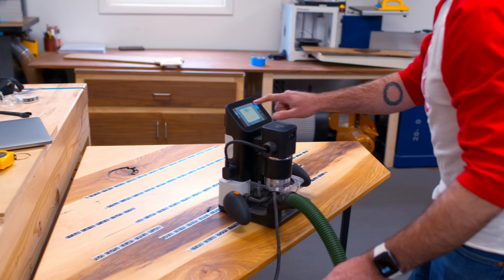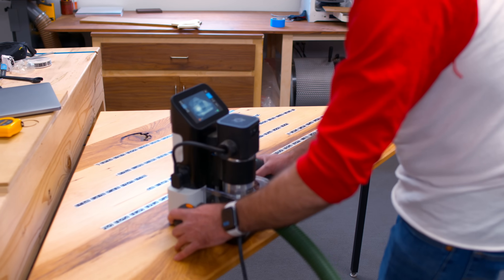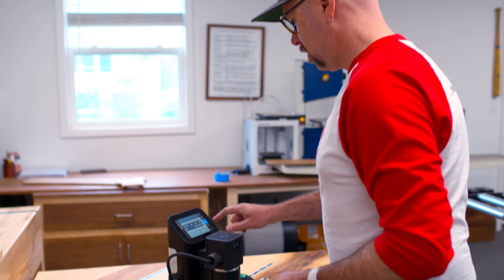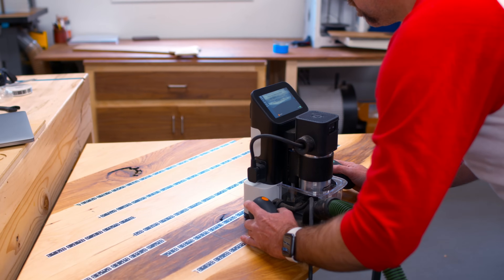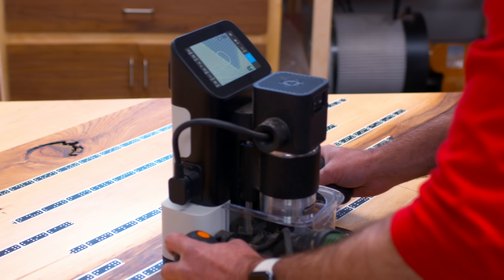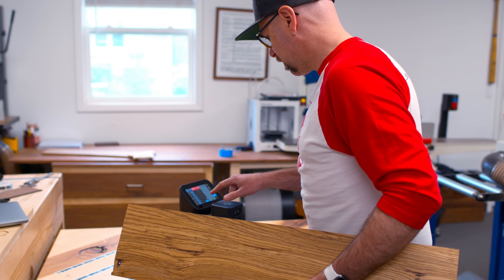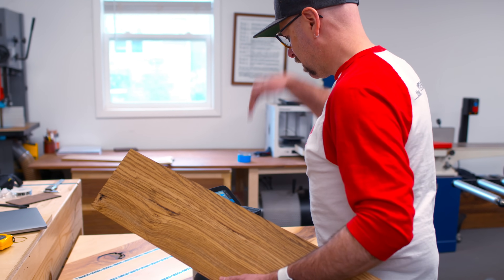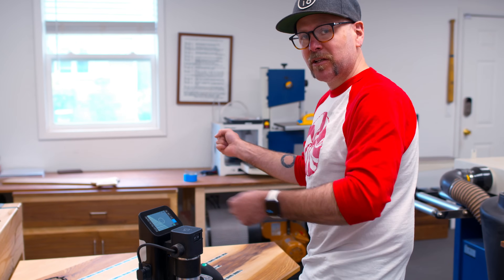Now that I have my tape on here, I need to do a new scan so the machine knows where it's at. We're going to start scanning. Now that that's done, it's time to import my artwork. You could do this through the cloud or use the thumb drive — there's a little USB port on the side. I'm going to import my design and use the lines I drew on the tabletop for placement. Hit the green button for place. I know the inlay material is 0.18 inches thick, so I'm going to enter that, and we're doing a pocket with a quarter inch bit. We need to do the Z touch to set the height.